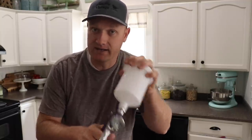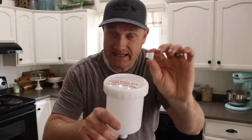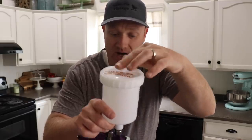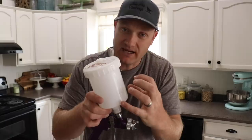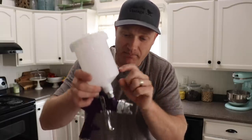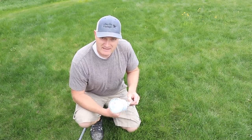Put the lid on and mix it up right in the spray gun. On top of the hopper is a little air vent — make sure that stays clean and unplugged. If you're not getting good paint flow through your gun, it's probably because that vent got plugged and you're creating a vacuum inside the hopper, preventing paint from releasing into the airstream.